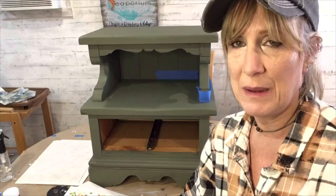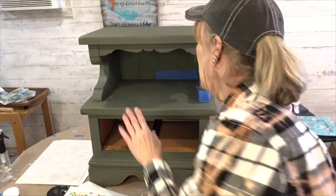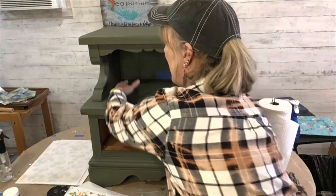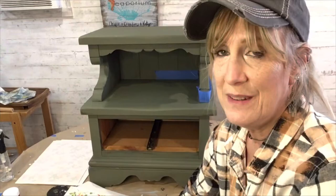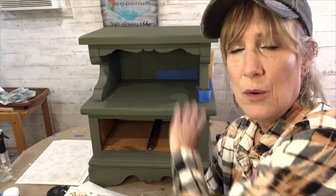That's all. All right. But since it is a paint and we just applied it yesterday, it's going to be a little water reactive. It's only been not even 24 hours. So if I apply just the paint here, and if I just wet it on this surface, it shouldn't really get onto the sidewall. And if it does, I haven't put a second coat on the sides, so I can give it a sand and fix that really quick. That's the reason why I'm doing this part first and not coating my second coat on the rest of the project. All right, so this is what we're working with.